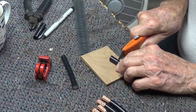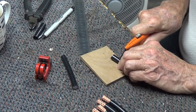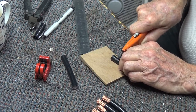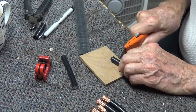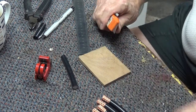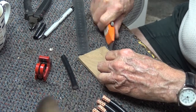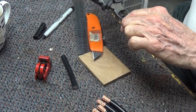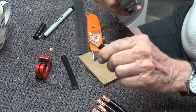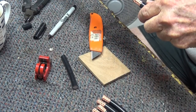I'm going around following the marker line from the pipe cutter and I can feel the braid underneath. Just once around is enough. Then put one cut down the centre and peel off carefully with the side cutters. Then checking 18mm.